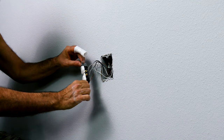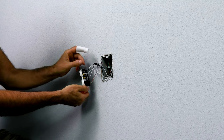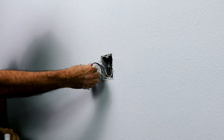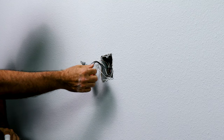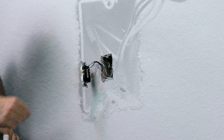Unfortunately, we've got two sets of wires. I don't like to use the push-in connectors in the back here. So what I'm going to do is take both sets of wires off and tie them into a pigtail, and then run one down to my new plug and the other pigtail back up to this plug.